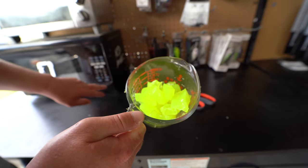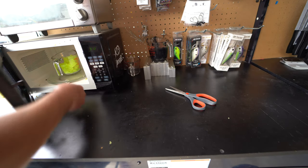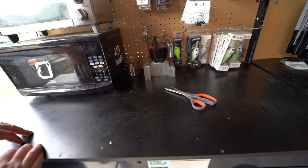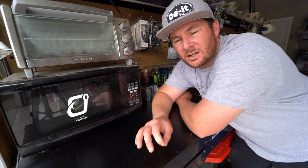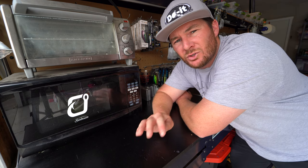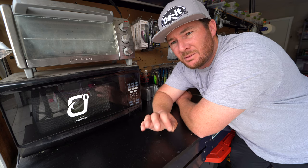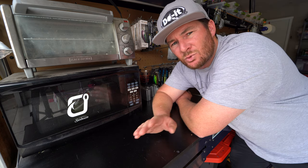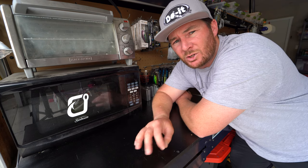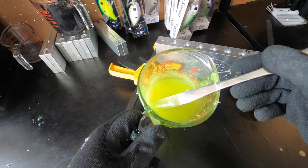Our plastic is cut into small pieces — you could go even smaller if you want. Now we're going to put the measuring cup of plastisol into the microwave and start heating it for one minute. I'll start with one minute, stir, one minute, stir, and as it gets warmer I'll slow the timing down to 30-second intervals, stirring so everything heats evenly without burning.